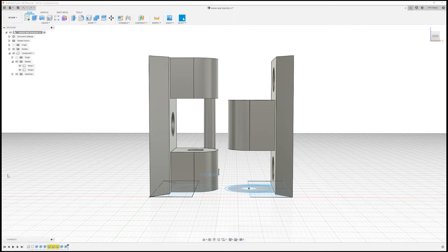However, if you try to mount something with more precision like a CCTV camera, you'll really want that friction, because a gust of wind or bumping the wall is going to make it move. A couple of simple ways to overcome that: super glue to hold it in place — not ideal, but it is a solution. Spacers between the hinge levels would definitely work — nylon spacers, or even round bits of cardboard with a hole through them. I also had the idea of weaving a rubber band between the upper and lower sections so that when assembled it adds friction — again, not ideal. We're searching for perfection, so let's jump over to Fusion and look at those minor changes we can make.